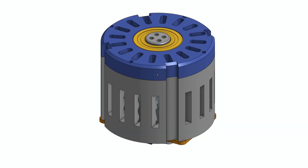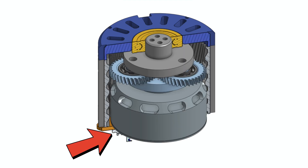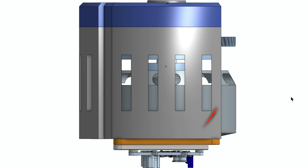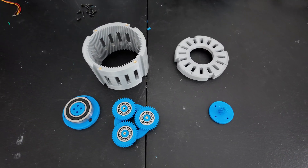After putting everything together, this is the design I came up with. What's really cool is everything's enclosed — the brushless motor is enclosed with the entire gearbox. But you have to make sure you leave a decent amount of ventilation to cool down the brushless motor, because they tend to get very hot, and the cooler you keep them, the more torque you can get. A very important part of the design is that you want bearings everywhere — the last thing you want is plastic rubbing on plastic, because it gets hot and you'll have plastic melting. Trust me, it happened to me. Use bearings.